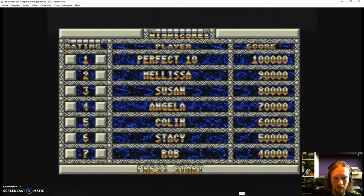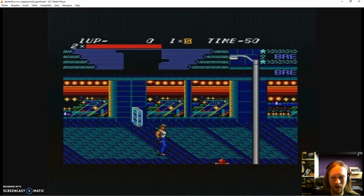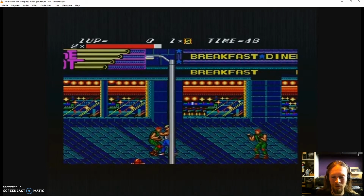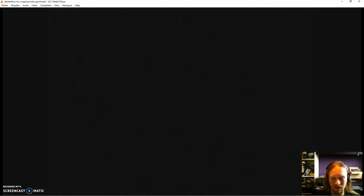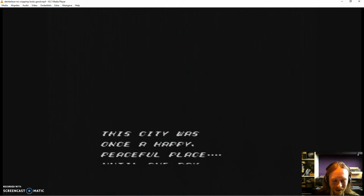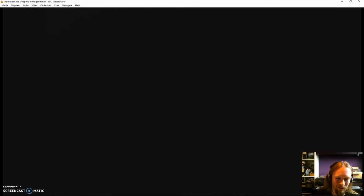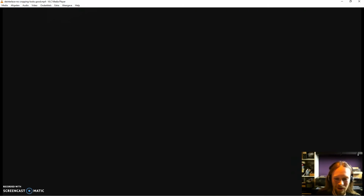And it's pretty stable now, no stuttering anymore. At first I thought there was some kind of sync issue, and I thought I had to use a sync stripper, and then my dad said, oh, that's really just caused by the interlacing. I've done a bit of research about interlaced signals, and I realized, oh yes, these consoles output a really low resolution progressive format, and it's electrically compatible with the interlaced format, but it's not a broadcast format. These recorders expect a broadcast format which is interlaced, and therefore they give a kind of funny result when you capture a really low resolution progressive signal.